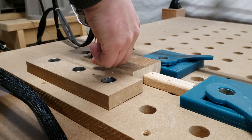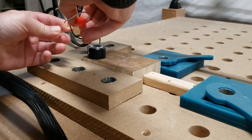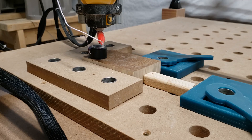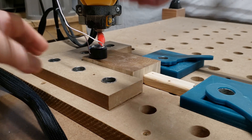This is a piece of maple that I'm cutting for the inlay, so I'm going to create the male part first. As you can see, this is set up with a one-eighth flat end mill. Once the height is set we can cut the first clearance path, then I'll switch cutters and put in the 30-degree cutter to create the entire profile. Once that's complete, the male part is done and then all we have to do is the female part.